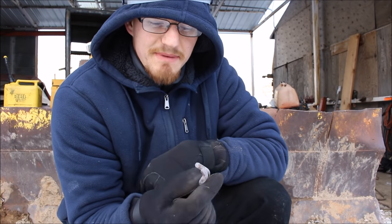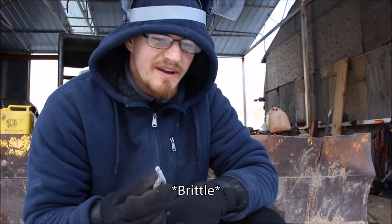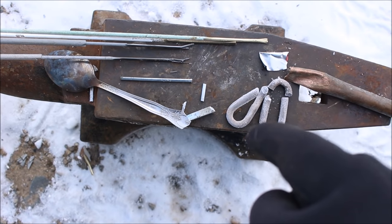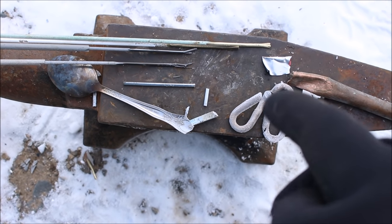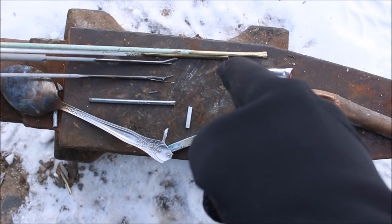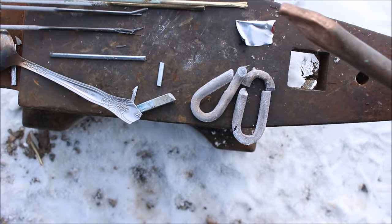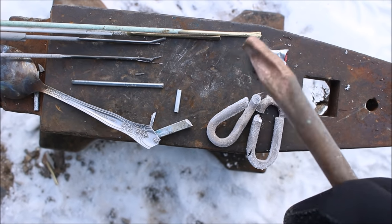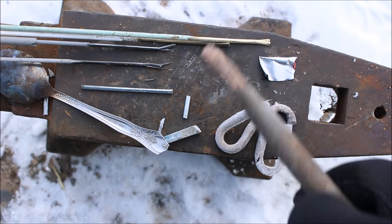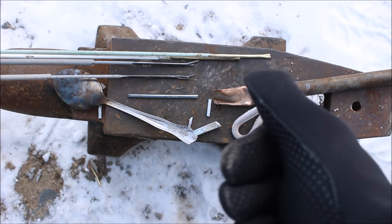It seems from my experiments that the cold makes it so metal can't bend almost at all — it makes it harder and more brittle. One thing I know for sure is that I'm not going to be able to cool a regular gun and fire it — it'll have to be made from some sort of copper-based alloy. Brass and bronze seem to do pretty well, a lot better than the steels. Pure copper looks like it does best out of anything, but it's kind of hard to cast and work with, so I might have to add a little bit of zinc. Hope you guys enjoyed — see you next time!